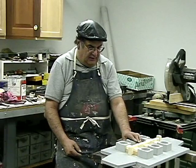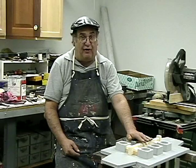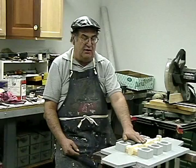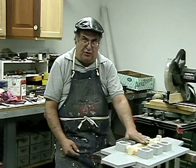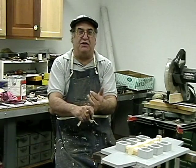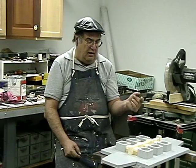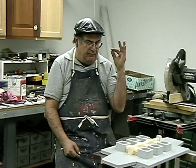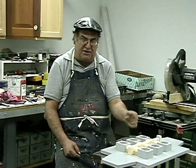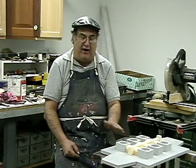Now, the one thing that I got to mention is you can use this for iron, but they don't like it. Once you set it up for either bronze or aluminum or iron, and that could be ductile iron, nodular iron, but mostly ductile iron these days, not for steel. Steel's another story. Once you set it up for one of those metals, either bronze or aluminum, non-ferrous or ferrous, you can't flip-flop them between the foundries because of the gating.